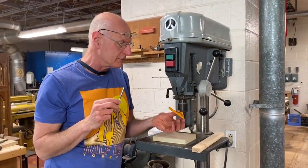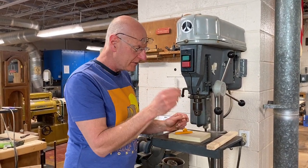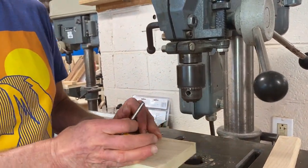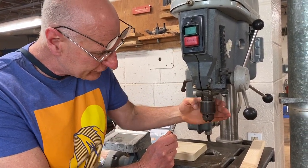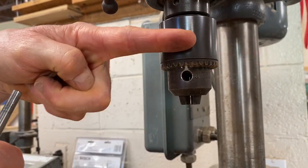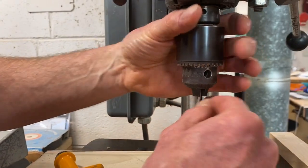And now I'm going to take my quarter inch regular standard twist bit. That bit was a lot wider than this bit. So if I take this and put it in, it's flopping around like crazy. Do you guys remember how you closed this jaw without using the chuck key a million times? You're going to take the sleeve. If I move the sleeve in this direction, if I face the front of it towards my right, you notice that those jaws will close down.